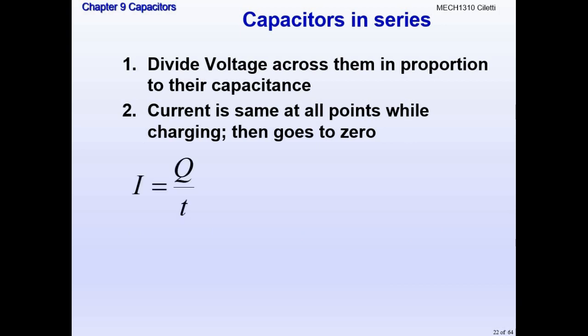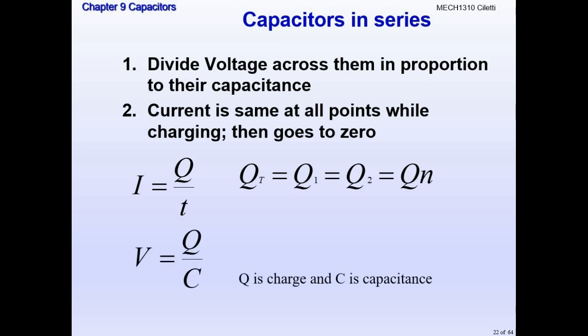All right, so we have to solve for capacitors in series. What I want to do is break down how we handle them. And this is where this chapter gets a little confusing. If you remember when we solved series and parallel circuits back in Chapter 4 and Chapter 5, we had to solve them a certain way. When we do capacitance, it's always opposite of how we did resistors. When we calculate total reactance for a capacitor, though, it will be just like resistance. So this is where we flip-flop how we do series and parallel. We're going to flop the mathematic piece for capacitors, for capacitance only.